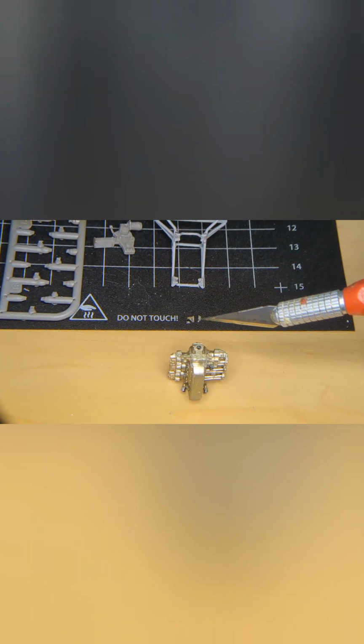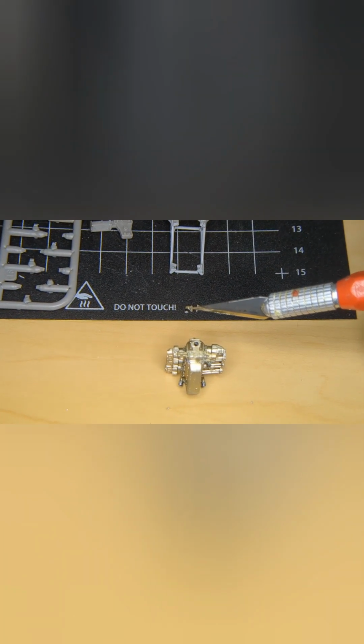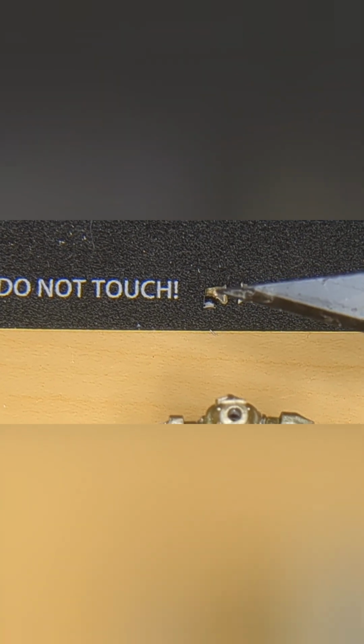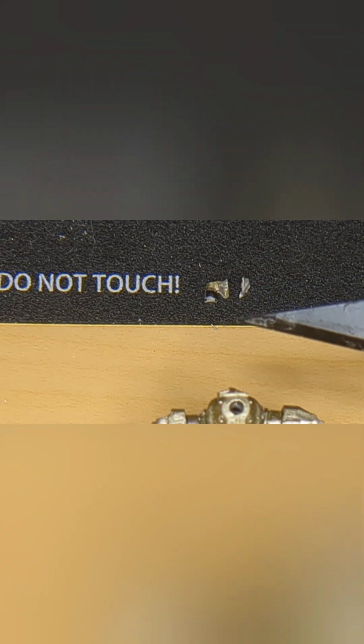So what I had to do, I had to modify them, and I had to put them on a right angle. If you look closely, let me zoom this up a little bit more. Okay, so now you can see the mount is on a 90-degree angle, which is just coming out of the crankcase and then going straight down on a 90-degree instead of making that V coming in towards the engine.